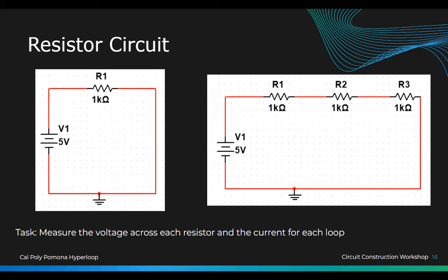Always start off with the 200 setting. Don't try to quantify yet, but make sure you set your meter's current setting to 200 milliamps. Always go for the highest value for the current first. So turn it to 200 milliamps first, then turn on your circuit. If it's too low, then just turn down one setting. Make sure you're careful.